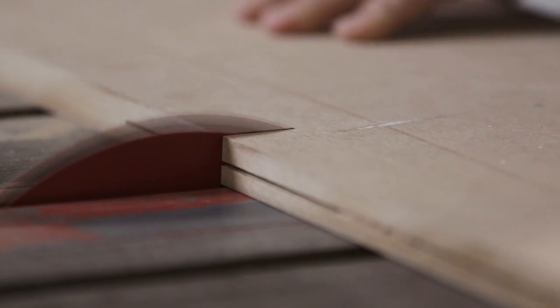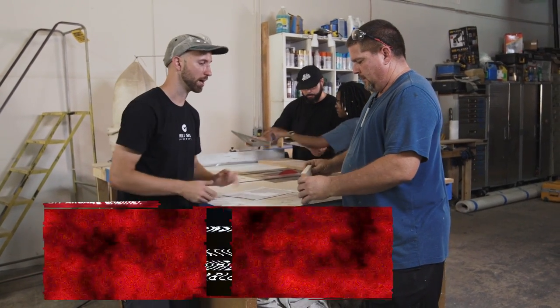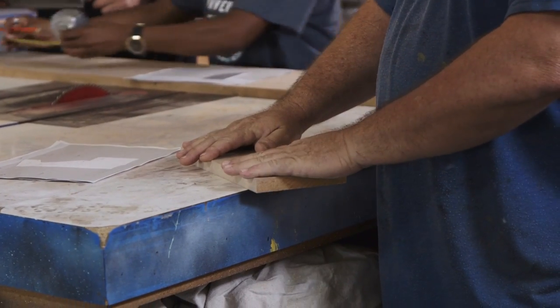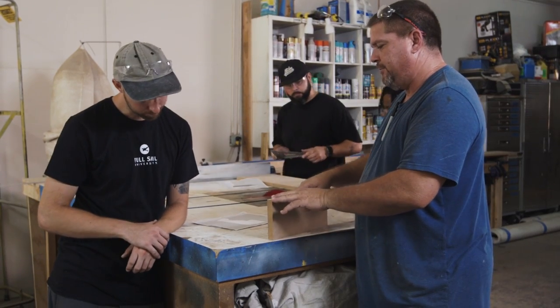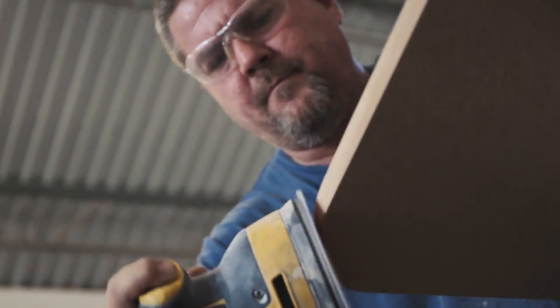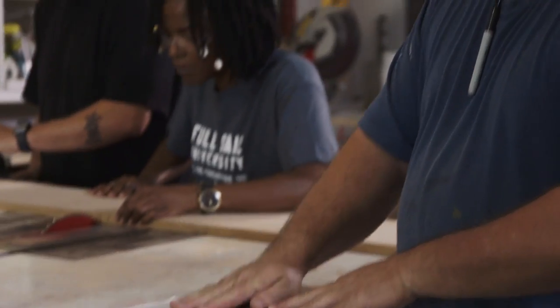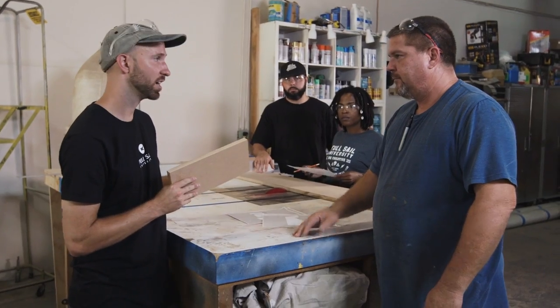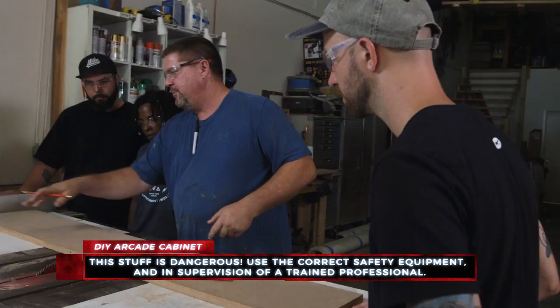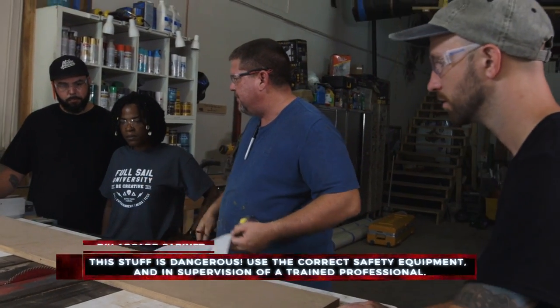Let's take it out to the workshop and see how it's gonna cut. Here are the paper designs right off the press. The material we're using is MDF — Medium Density Fiberboard — available at any wood outlet. Unlike plywood, which is sheets glued together, MDF is the same material all the way through. No matter how much you sand it, it'll look nice and smooth, and it's a great surface for applying graphics at the end. When cutting: constantly press on the plate as you go through, push it all the way past the blade, turn it off, and wait for it to stop before removing your material.